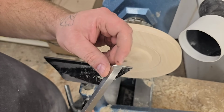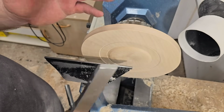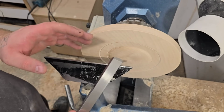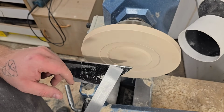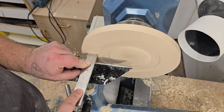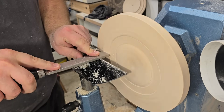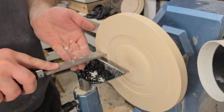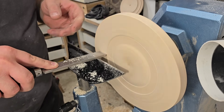So if you just polish this, let's say with a hone, the bottom bevel, the top bevel, in most cases nothing will happen. But on the timber, on the wood that we are using, you want to have a burr on. So let me show you how this negative scraper, when the burr is gone, where it's dull, how it performs. So you can see I'm still getting something off. Show you from a different angle as well. So you see I'm still getting something, but I hope you can also hear vibrations that I'm getting off.